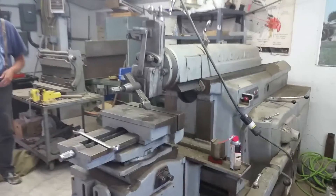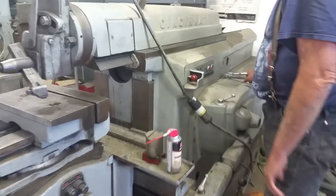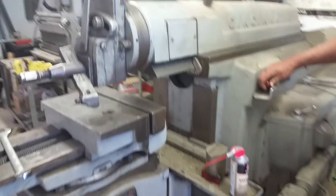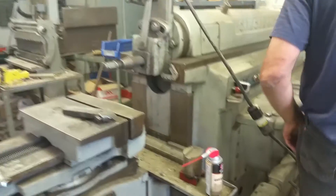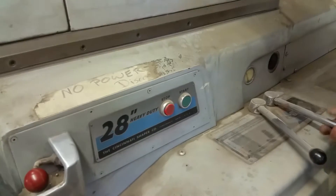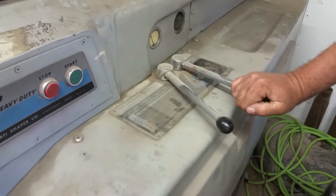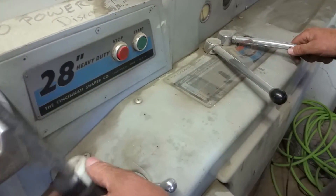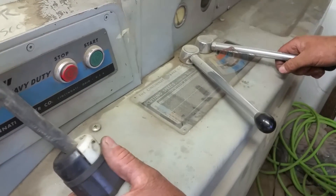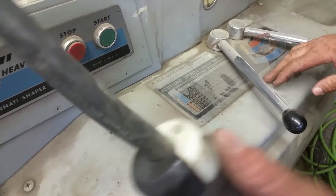How come you don't use it anymore? I'm not building more of those kind of cannons. Make sure you're adjusting for your speed. What's your speed range? 9 to 119 strokes per minute. And then cutting speeds as far as feet per minute — you can go from 9 strokes a minute to 119. And then you can go up to 28 inches.